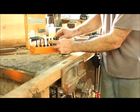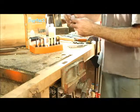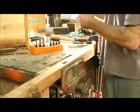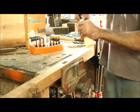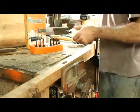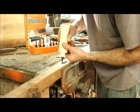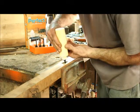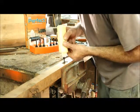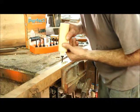This one in particular is for mortises, and I'm going to use the mortise one right now just to show you how it will most likely help me get my glue in there. I actually discovered that I saved a lot on glue when I was rolling it the other day. So I've got glue coming out on a flat surface, from a flat surface through a nozzle onto a flat surface — and what that does is allow me to smear it on evenly with minimal squeeze-out.